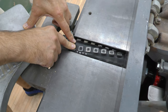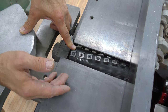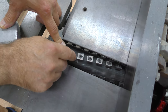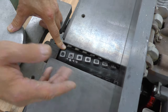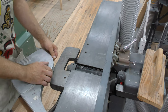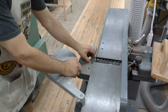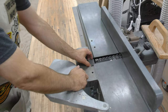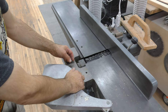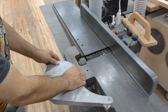I don't know how many knives are on there, but you can see they have four different cutting surfaces. So if they get dull or if they get nicked, you simply loosen the screw, rotate it — it's self-seating — tighten it up and away you go. And the fact that they're numbered, you know which one you've used and which one you haven't. There are two bolts on either side that hold the block containing the bearing. Once you've taken the old one off, you may as well change your bearings at the same time if you've got it apart, then reassemble — it really is quite simple.